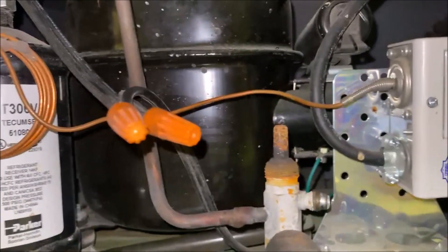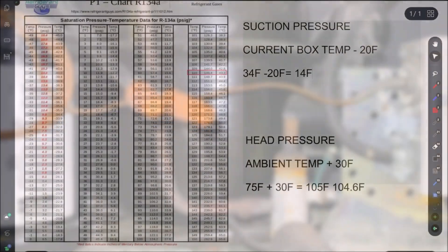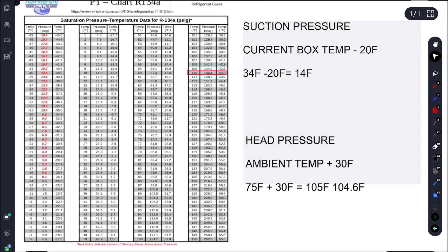There is a chance the high pressure switch was failing prematurely. They empty this unit every night, and I gave them the option to change it — I did send a quote, but this call was from three weeks ago and they haven't called back. Whatever we did, cleaning that condensing unit has rectified the issue and we are all good.